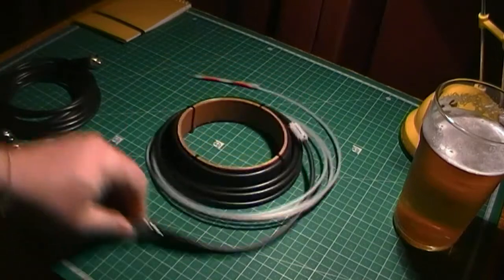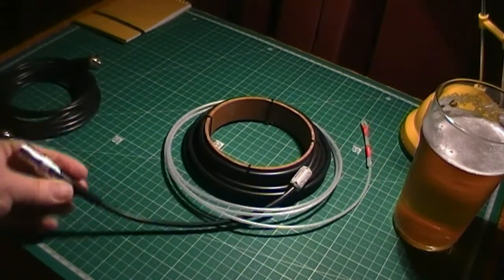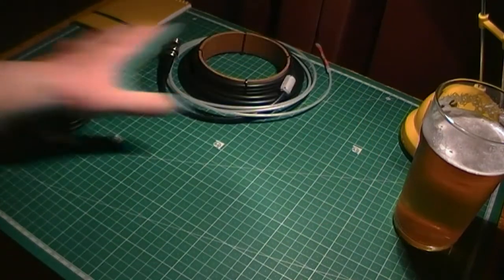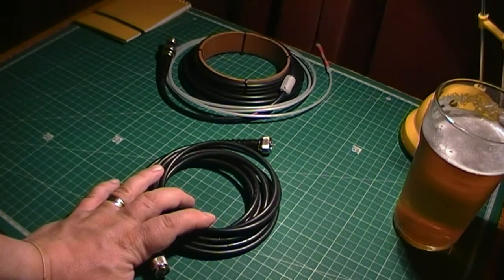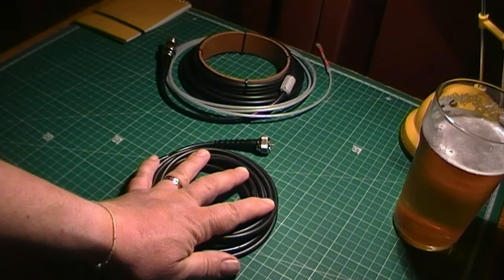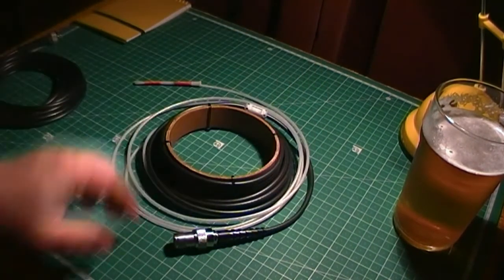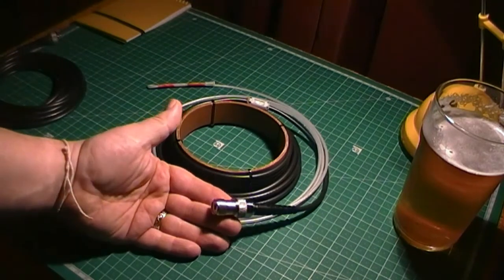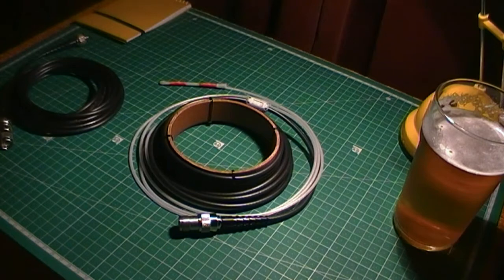On my particular one, I made the PL259 off only about a foot from the choke — SO239 coupler — and that gave the option to use that feeder on the day. But I could have used any feeder I wanted, longer or shorter. I could have gone over to RG213 for a long run, or RG8 mini for a sort of medium-to-long run. Choice is yours. Also, whether you just want to leave it long enough to go straight to your radio and eliminate that extra potential point of failure — go with what you want.